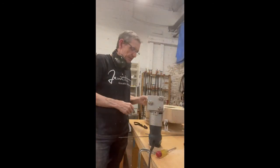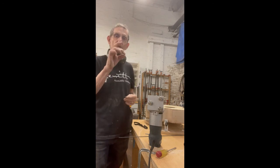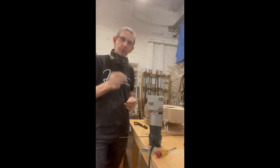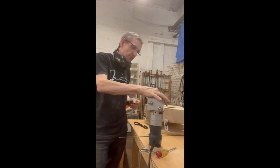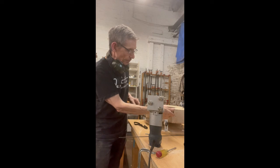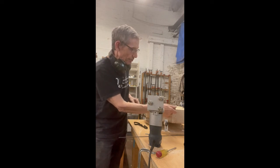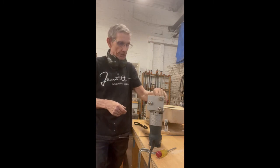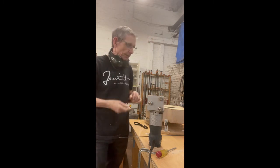Now, when you buy this bearing set, you'll also get some of these little brass washers. And what those are used for is to drop the bearing down far enough so it doesn't have the possibility of riding into the binding channel you just cut and throwing you all off. So make sure you put those little brass washers on before you install the bearing for the purfling channel.